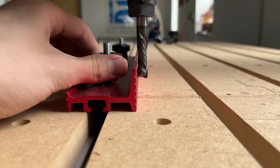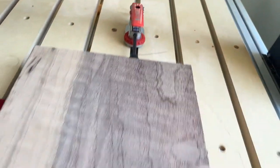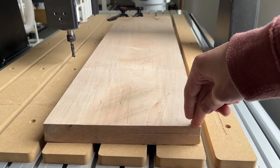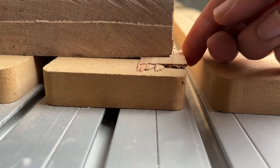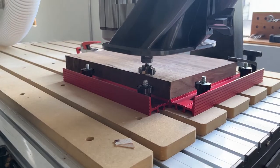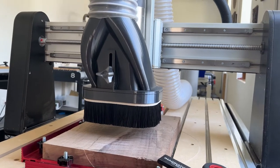Make sure your fences are parallel to the axis of the machine by running the spindle along either axis and lining up your fence. Once it's squared away, secure your material to the machine bed. For the first side you surface, you will most likely have wobble due to the opposite side not sitting flat on the machine bed. In order to ensure a clean surface on your top side, you need to add some kind of shim to the bottom of your wood until there's no wobble when you press on any of the corners. Set up your axis reference points, load up your toolpath, install your bit, and do a quick border check to confirm your X and Y zero points and to make sure your bit is clear of any obstructions. Lastly, dust collection is highly recommended for any surfacing job, so make sure you have something before starting the cut.